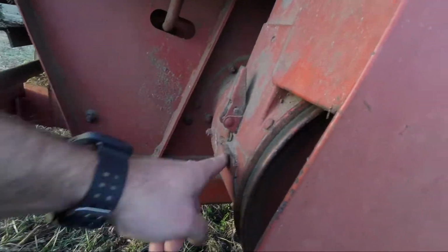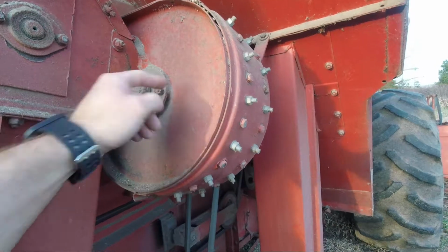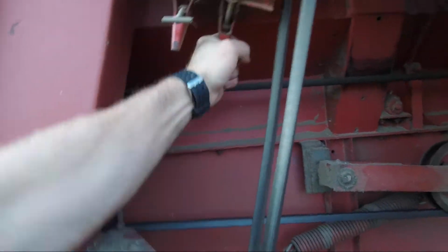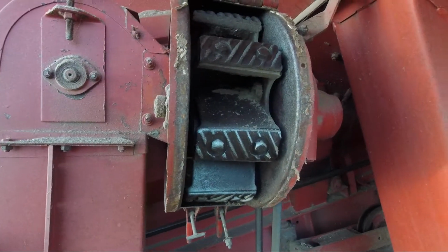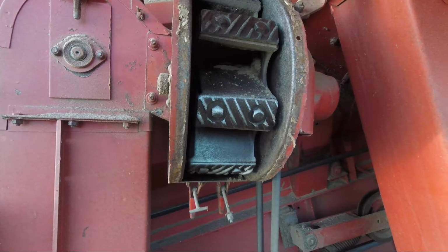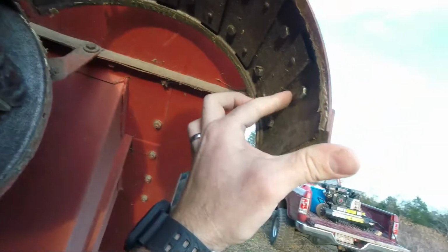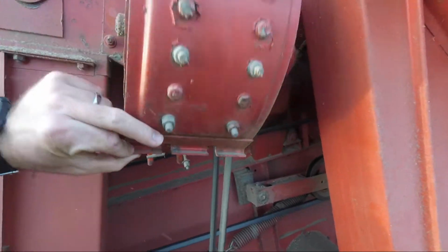It will come out here with this. There's an auger in here that would auger it out. The elevator carries it up, dumps it into the re-thresher. This is just a smaller version of the cylinder that's up front. This gives you a good idea what the cylinder looks like. This is just a much smaller version. The one up front's like 48 inches wide, and this will re-thresh any pods that make it through the machine without getting threshed the first time.